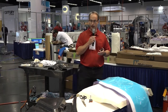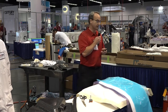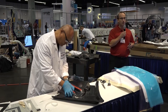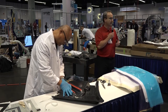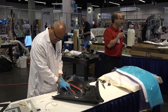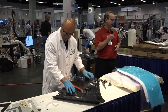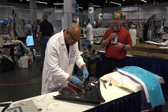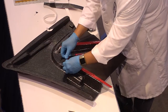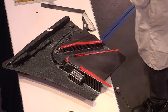We've already started building a part here. You're going to see how Raymond works with the carbon epoxy prepreg. For those of you that might not know what a prepreg is, it's basically a dry reinforcement — in this case, carbon fiber. We can also have glass fiber, aramid fibers, or other exotic fibers, and it's pre-impregnated with a resin system, in this case epoxy. The product we're using today is a 200 gram per square meter, two by two carbon twill.